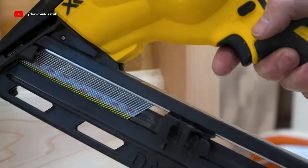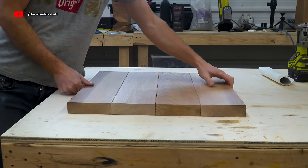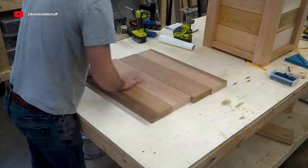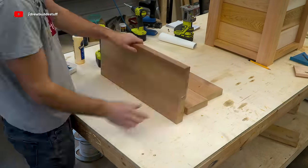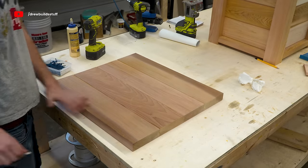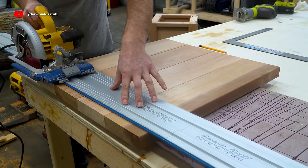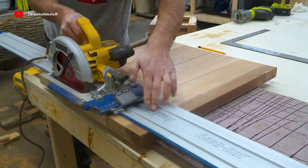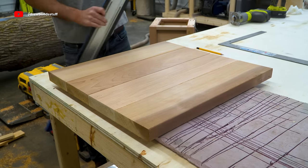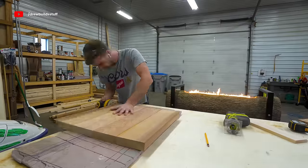If you want to learn how to install tongue-and-groove paneling without any exposed nail heads, you can watch my sauna video. Now I'm making a tabletop from cut-up pieces of clear cedar two-by-six, joining them together with the factory edge since it's fairly square. I drilled in some pocket holes and used pocket hole screws and glue to hold them together. I made the pieces a few inches too long so I could cut the whole thing to final dimension as one piece, ensuring a perfectly flush edge. I used a track jig for my circular saw — if you don't have one, you're missing out.